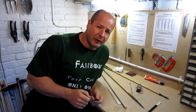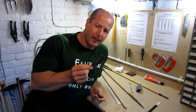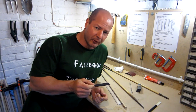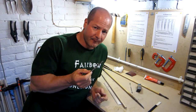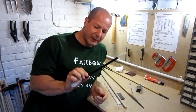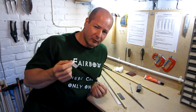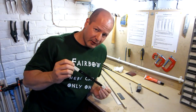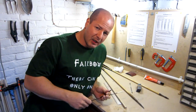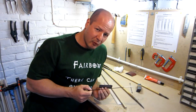I now need to follow those cut lines to make the slot that's going to take my piece of horn. I want that slot to be exactly the same thickness as the piece of horn, which is about two millimetres thick. To do that, I've taken three standard hacksaw blades and joined them together with a piece of tape at either end. By using three blades together I can make a cut that's exactly the same thickness as my piece of horn.